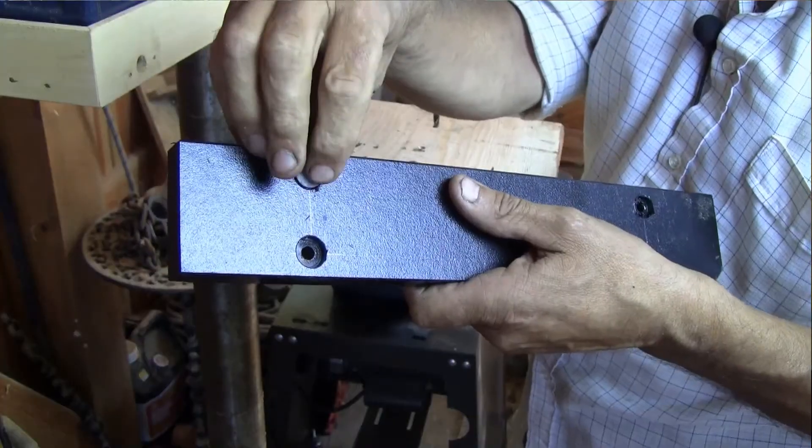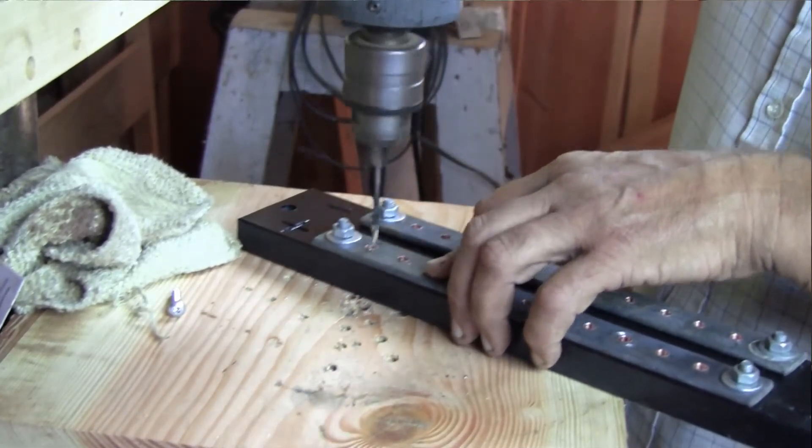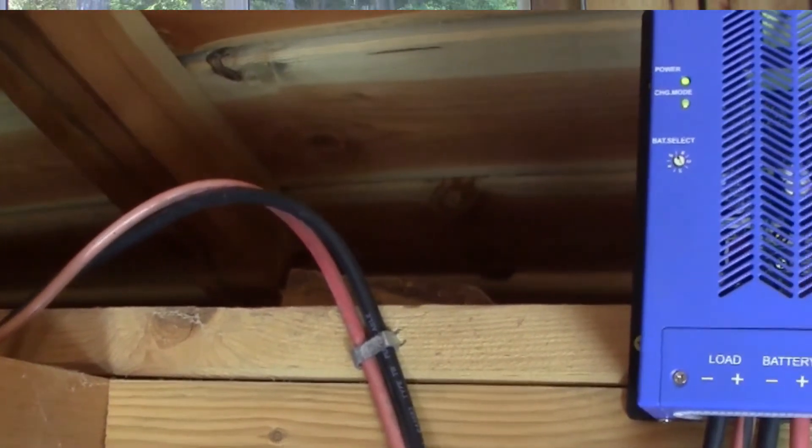Before charging the batteries and distributing power I need to fabricate a bus bar. It's a simple device which accepts power from the load terminals of the charge controller and makes it easy to hook up various loads as the need arises. Bus bars are easily bought complete but I happen to have scrap parts available which when assembled will make a very heavy duty unit that will last a lifetime. The backing material is a chunk of 3 quarter inch non-conductive polyethylene to which I will attach a couple of thick lead plated copper strips previously drilled and tapped to allow the connection of terminal wire ends. This particular charge controller can control the load in a number of ways including low voltage disconnect, low voltage recovery, automatic reconnection, and importantly electronic short circuit overload. Read the comment section for details on where I bought the controller — there are many types available but at the moment this is the one that works for me, also considering price and excellent service from my supplier.